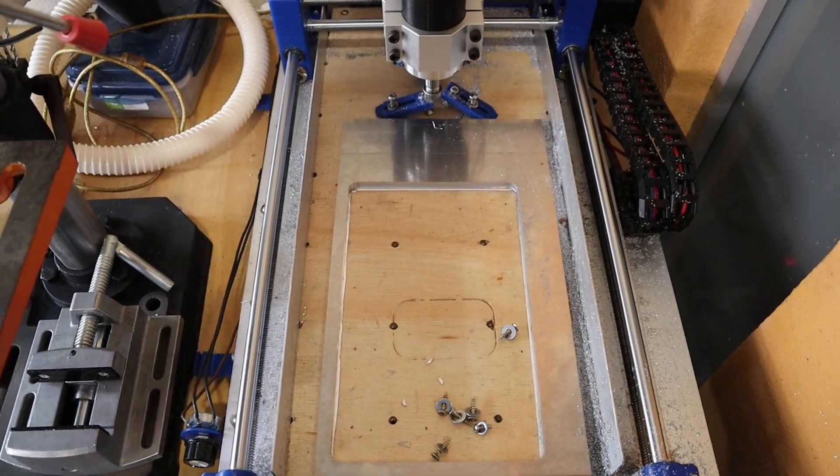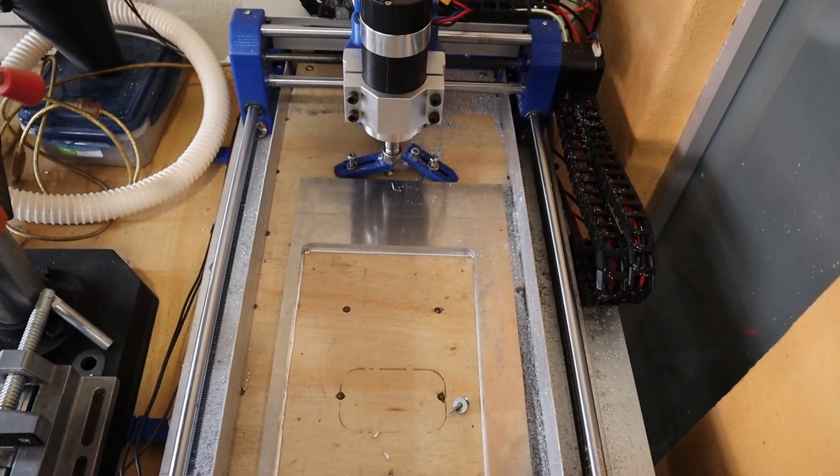In a while I'll show you the 3D CAD model to give you guys an idea of the CNC machine I'm building. By the way, Nicodem Bartnik's CNC machine is called the Dremel CNC machine. After using it for a while, I quickly noticed there are a lot of limitations — the rigidity of the machine is very bad, there's quite a bit of backlash so the parts it machines are not that accurate, and secondly the Z-axis travel is pretty limited. Essentially I can only mill parts that are no more than 12 millimeters at most.